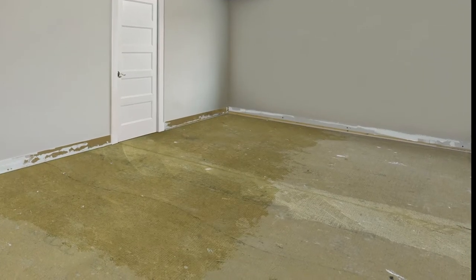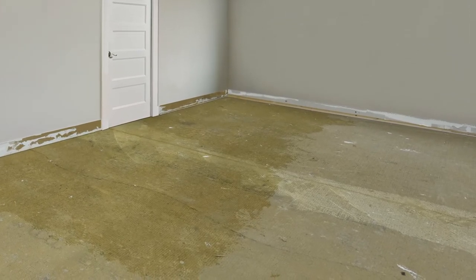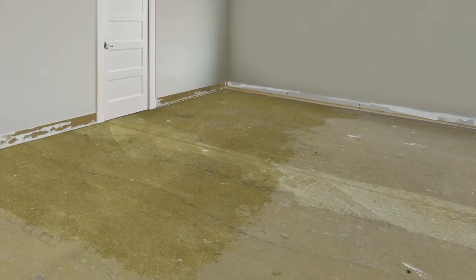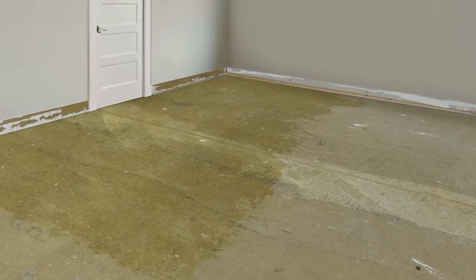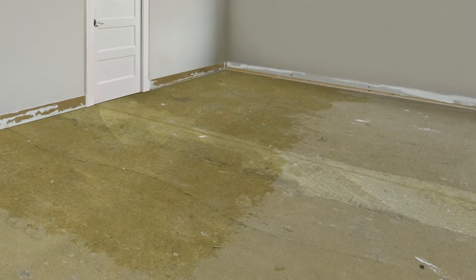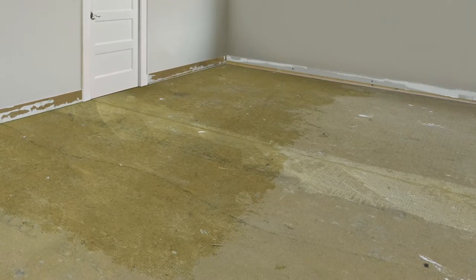Today we will be installing our glue-down carpet for use indoors. However, when installing outdoors, make sure the outdoor temperature is between 55 and 95 degrees Fahrenheit, and the humidity between 10% and 65%. Always check the glue instruction label to clarify the temperature and humidity specifications for installation.